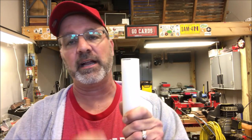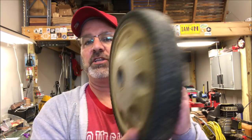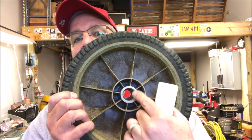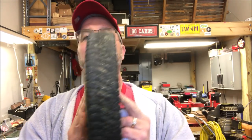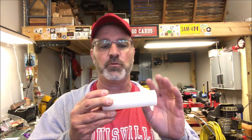What I'm gonna do is I've got a piece of Delrin here — I wish I could remember who sent this to me because I'd like to throw a shout out their way. I'm going to measure the width of this inside piece here and cut off a piece that distance, turn it down to fit the outside which is a larger diameter than the axle, then turn a tenon on it to fit all the way out to the front of the tire so I can slide that piece inside and have a bushing from front to back. I can use a fender washer in front and back, bolt it right back up, and that pressure is not gonna be as hard on it because it's gonna have this entire inch and a half thickness of Delrin supporting the wheel. That was a long explanation — let's head over to the lathe, take some measurements, and get this drilled out for the axle and turned down for the inside of the hub.